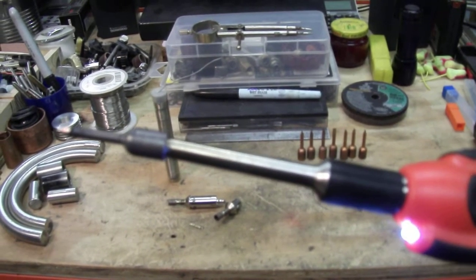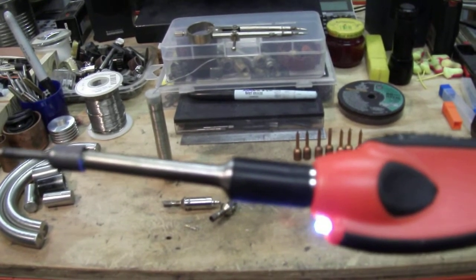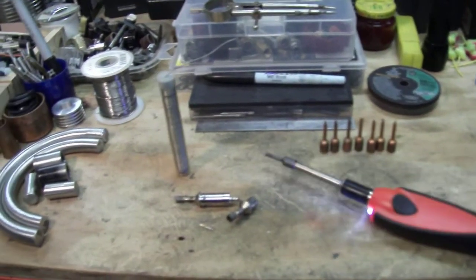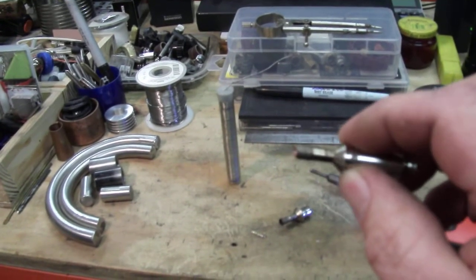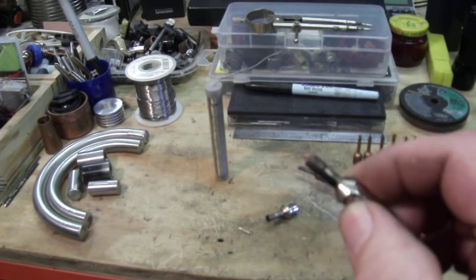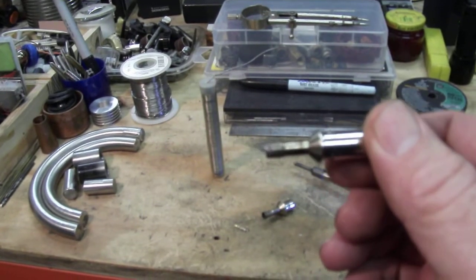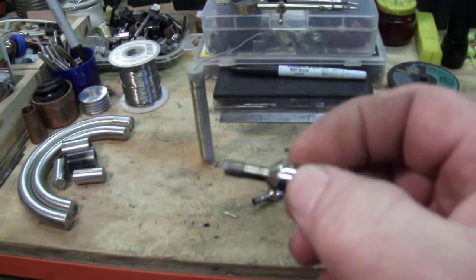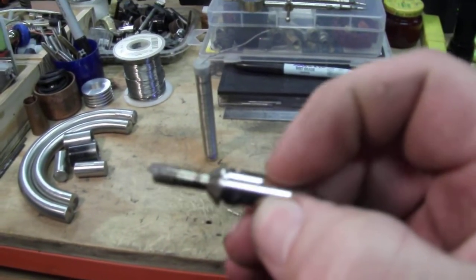It's all one piece except for the copper tip on the end, and where the black is there's two pieces. What happens on these tips is that the very tip of the copper burns up and then it shorts out. What I did was drilled all these little spot welds around this tube here.